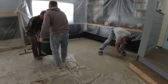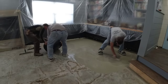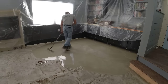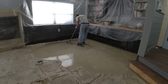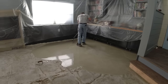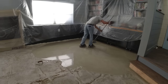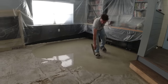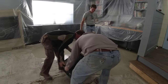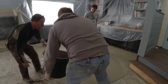Because this floor sloped to a drain so much, I had to keep bringing it back to where I needed it. What happened with the second batch was we got just a few little lumps in there. Occasionally that'll happen when you're mixing a powder with water. But you saw how I took care of that — they were just about the size of a small marble. I just took my hand trowel and smoothed them out, and they mixed right in with the rest of the mix. For the most part all the batches came out really nice; there were just a couple here and there with a couple little lumps I had to smooth out.